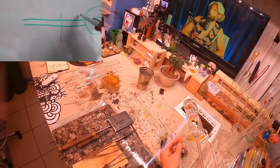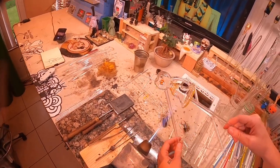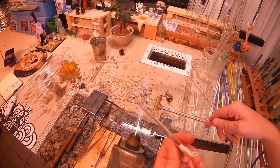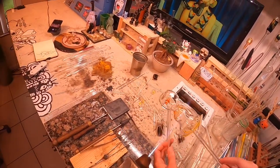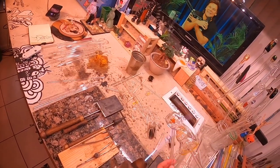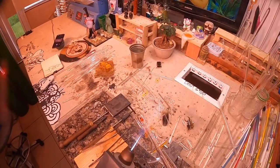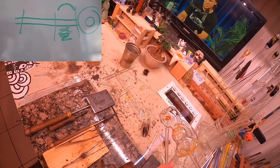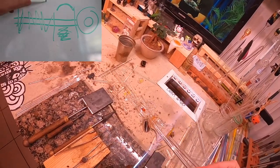I've got a little diagram for the bend. Whenever I bend it, I get a nice soft flame and heat up the top part of the arm first. I want that part to bend first, and whenever the glass starts feeling loose I'll move on to the second part. I've tried the second stage flame — it works faster — but I've figured out that doing it slow like this works a lot easier. When the first section is bending, I move the heat to the next part.